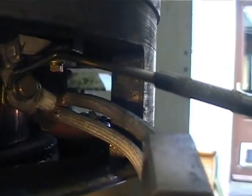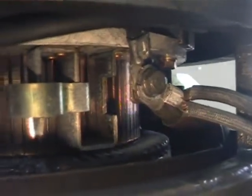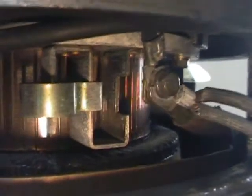I'm going to go ahead now and hook up these two, put in the brushes, and spin the thing up. This is the last brush to go back in. Just attach the cable back on here — simple enough job, ten mil. What I've done is I've got this scriber and I've just hooked it underneath the brush spring here — just pull the brush spring up, pop the brush in, and let it back down onto it. Unfortunately I need three hands to film this. Brush is back in, battery hooked up.